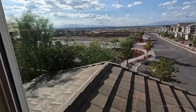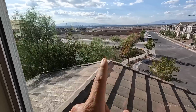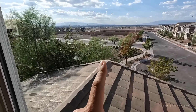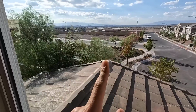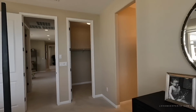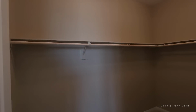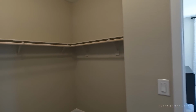Okay. Now, you see at this end cap of the roof tile, every year you might want to check that because it gets so dry, okay? That tar right there, that seal, will end up drying up and cracking. You don't want water to get in between that, okay? Something that you should be really checking on, because the problem with a house is it costs us a lot of money to own a house. A lot of deferred maintenance happens, believe it or not.